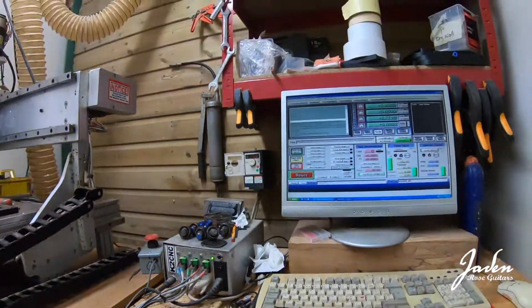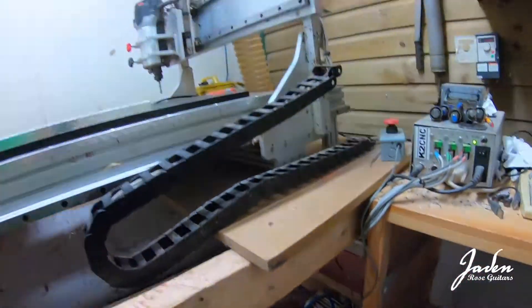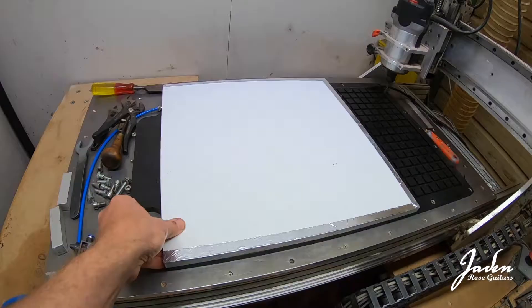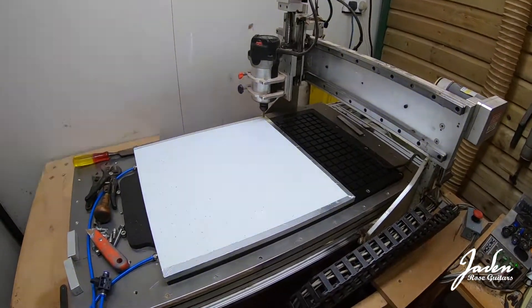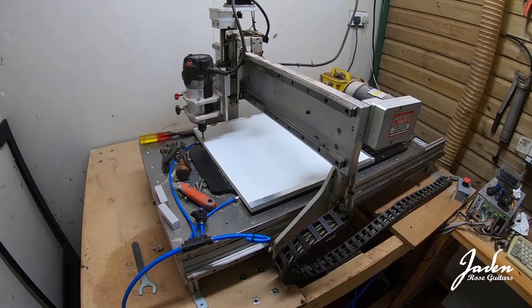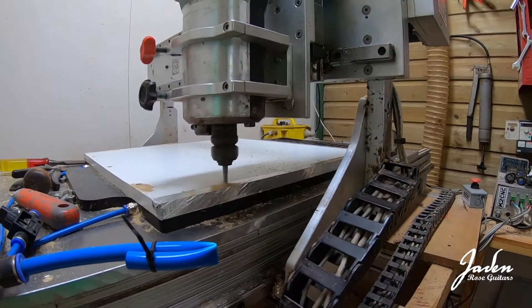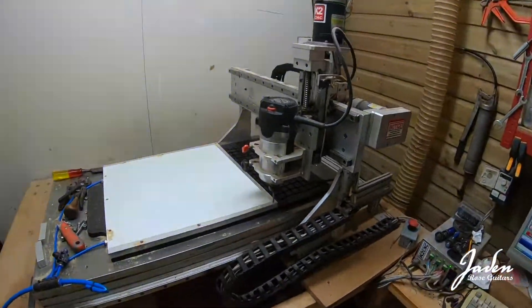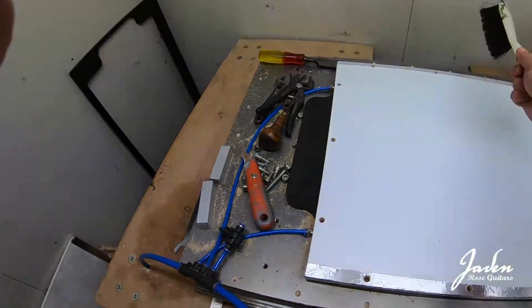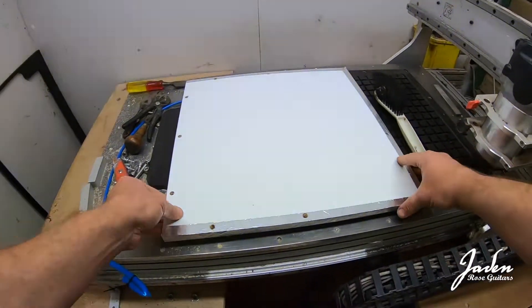Up on the wall there's a little inverter, and that runs a little teeny three-phase pump down there which provides the vacuum for this bed. So we'll get the vacuum on the bed, set up the CNC, get the holes cut. Brush it off a little bit. Now we can mount that there before we turn on the vacuum and know that it's in exactly the right place.